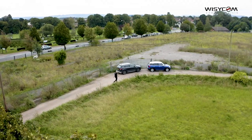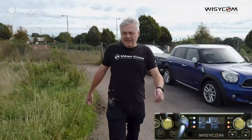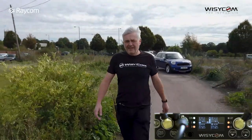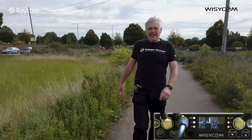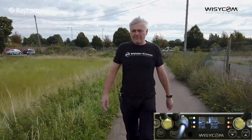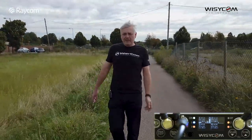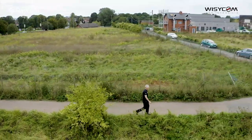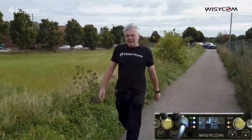If you haven't seen our other walk tests, do subscribe and have a look. DME is something a lot of people are scared of because they haven't used it before - it's up in the aircraft band and people worry about interference. In actual fact, the incoming interference from DME is much reduced if you use frequencies in between the exact megahertz marks - say around 962.35 or .8 megahertz as the decimal points - keeping away from the actual DME beacon channels.